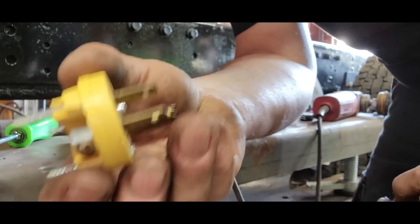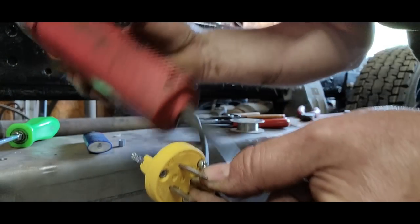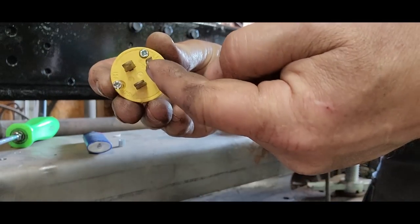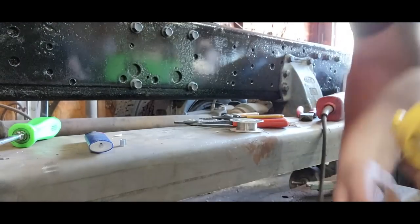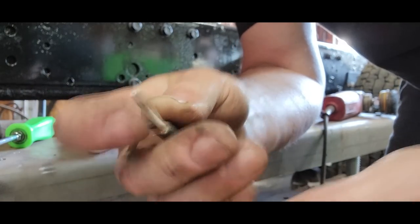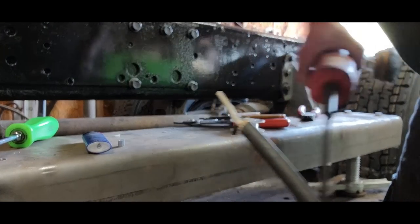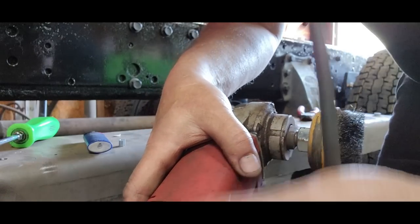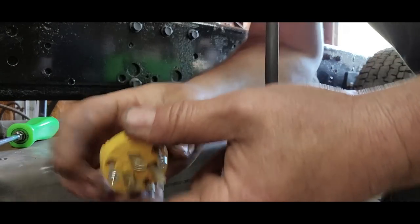This is a cord cap I'm going to use, and it's important to match a cord cap to match or exceed the amperage draw of the tool you're putting the cap on. You also need to match conductors — if your cord has three conductors, you need three conductors. This one here is for personal protection. Our cord only has two conductors because the body of our tool is plastic. If this was metal, you'd more than likely have a ground in here, which would help protect you from any electrical short that could touch the metal body of the tool. You've got to match all that up.